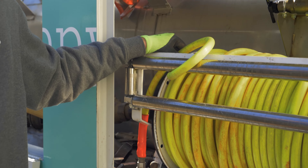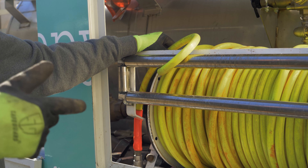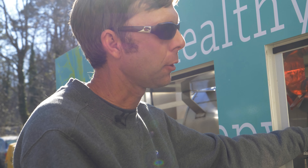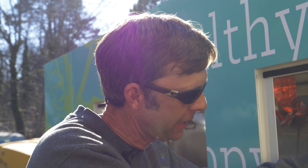You may have fresh water, fertilizer in the middle tank, or another product in the third tank. Whatever you did last is going to be in that hose. This is 400 feet of hose, so you may have two to three gallons of material in it. You're going to have to recirculate that out to get the other product coming through. So if you just wanted fresh water from the 300-gallon and you had fertilizer in the hose, you've got to recirculate the fertilizer out until you get fresh water.